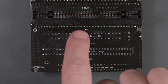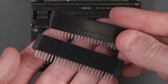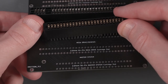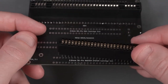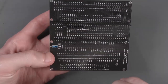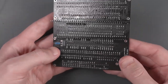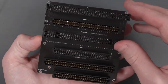After a while, all the cartridge slots are now soldered into that board. There was flux everywhere, but I cleaned it up with some isopropyl alcohol. We have a semi-clean, slightly sticky cartridge slot PCB.